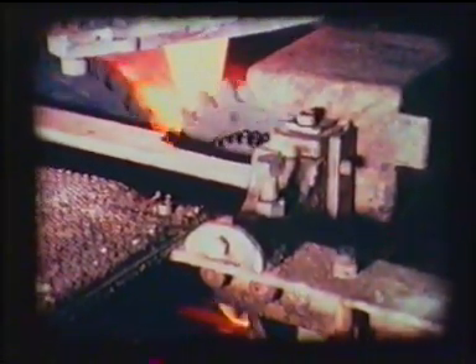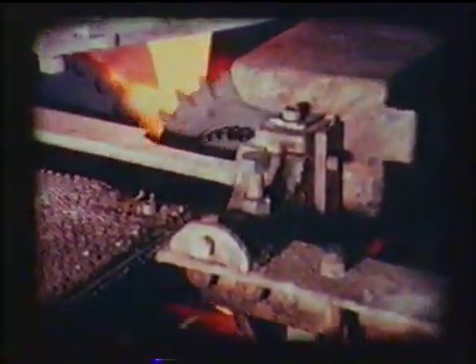Now to look at this in detail. A stream of molten glass leaves the furnace and enters two rolls — one being a pocket roll and the other having a plain surface. The glass is rolled into a ribbon with pockets of glass at regular intervals, each pocket locating with an orifice in the plate.